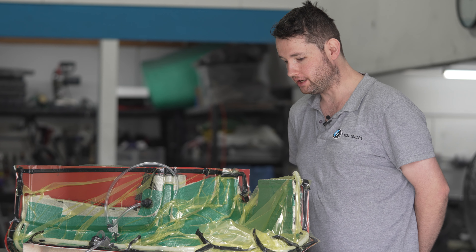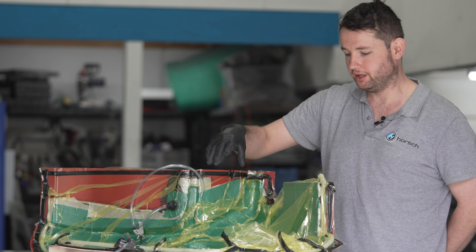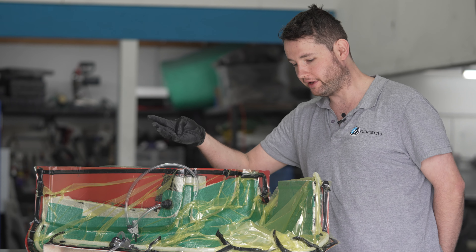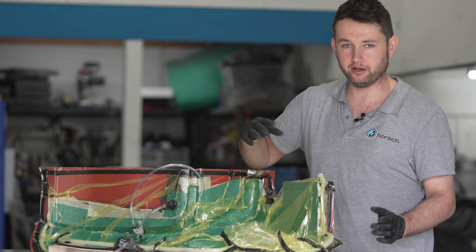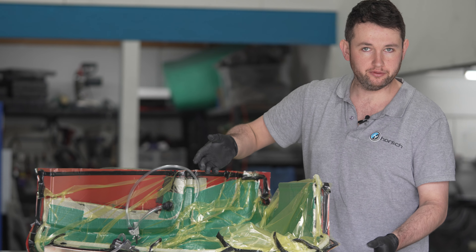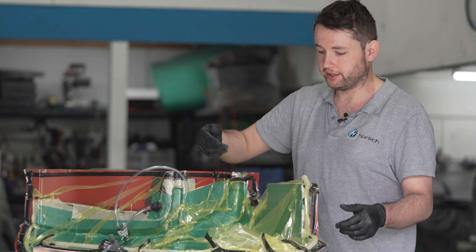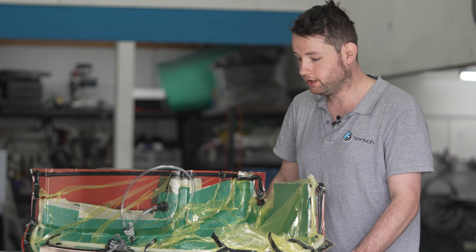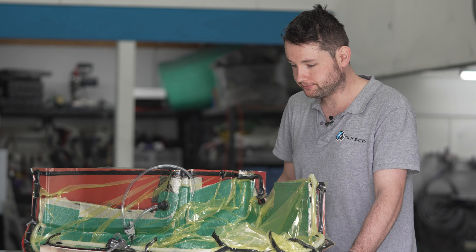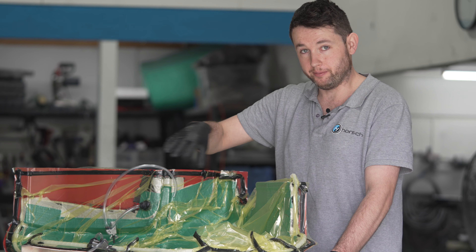As you can see here we've got the side panel here ready to infuse. Basically the way that we do this is we lay the fabric dry into the mould. In total here we have about four layers. You have to be careful about how you lay it up in the mould because you don't want any warping of the visual layer. After you've done that first layer you would back it up — in this case with three other layers of 200 gram carbon fibre. Once that's done we put a peel ply over that, which gives a nice surface finish for the behind part.